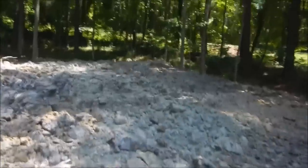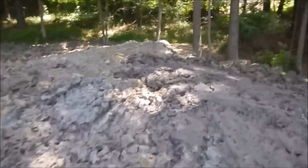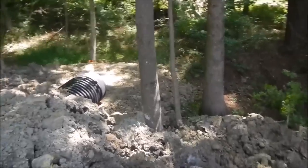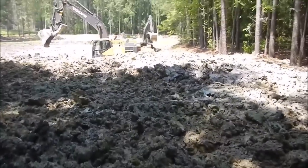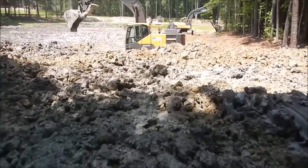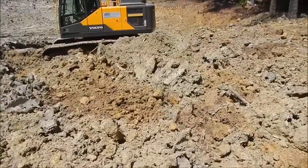And then we got a pipe right here. Put in 80 foot of 24 inch pipe. What that'll do is let all this water from the ditch here flow into it. Got it where it'll drain out of there and everywhere. It should come to this pipe right here and then run on down. I left it a little bit high because, like I said, it's all mud. It's going to settle. And the water should be about 6 inches of fall on it.